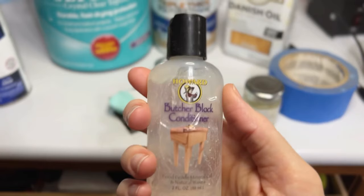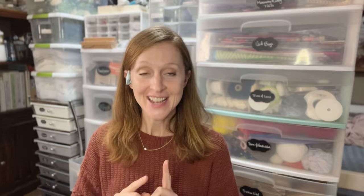Butcher Block Oil — the thing to know is it is petroleum-based, so if people are concerned about natural sources in their kitchen, this might be questionable depending on who you talk to. Products like Howard's or Walrus generally use a petroleum-based oil and conditioner, but they're fairly inexpensive and really easy to find. Mineral oil — make sure you're using food-grade mineral oil. You can actually find it in the medicine section, in the laxatives. It works really well for finishing wood and is a lot cheaper than most butcher block oils. But it is petroleum-based.